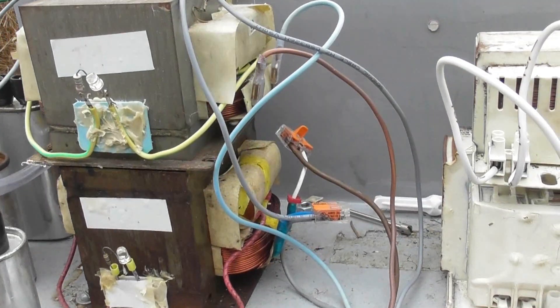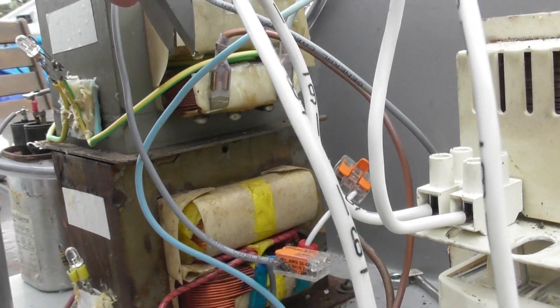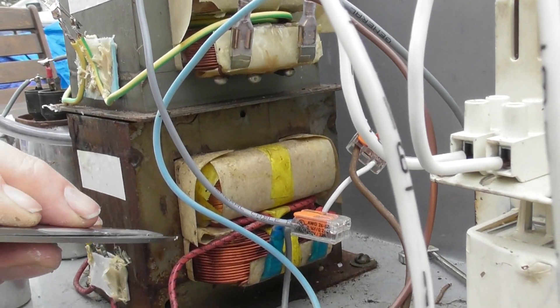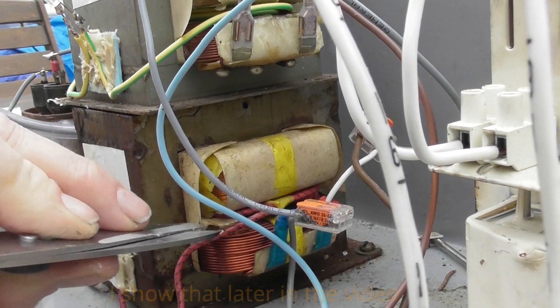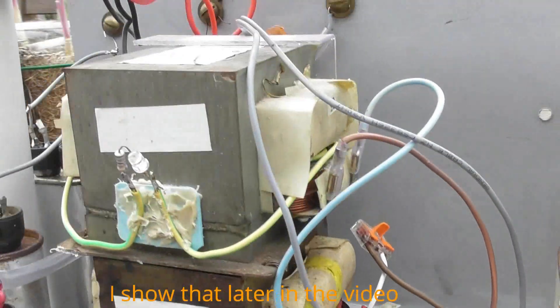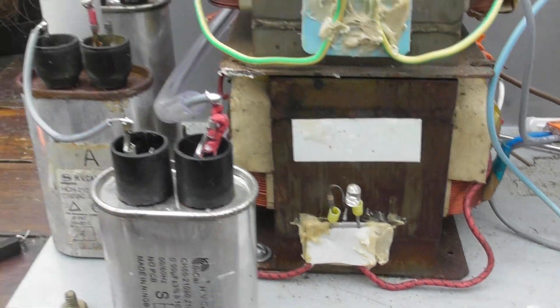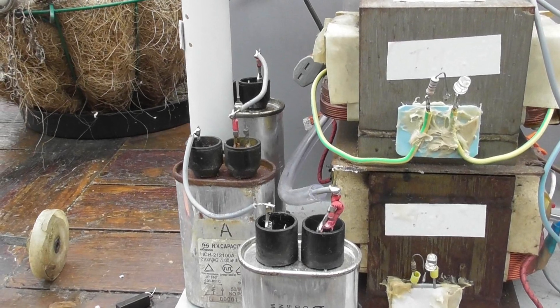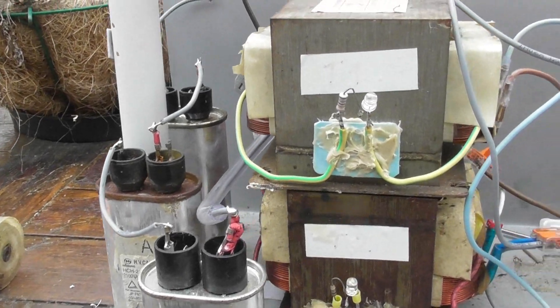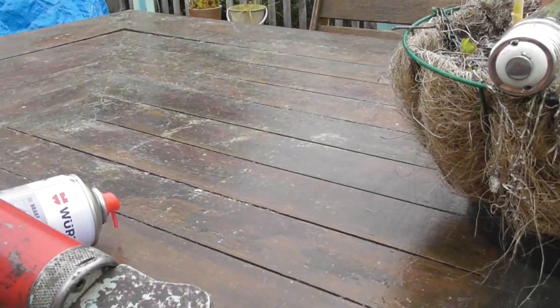That means the blocks in the middle — the metal blocks, or magnetic shunts between the coils — are being removed. I put pilot lights on there, two LEDs. I'm just working on it and fiddling around with some capacitors. I'm going to strip a microwave shortly and I'll show what parts are quite useful to use.